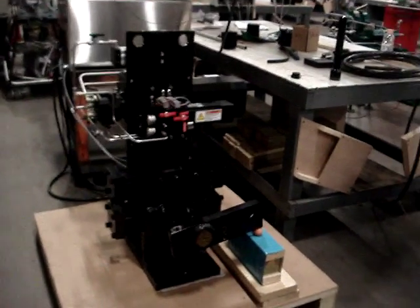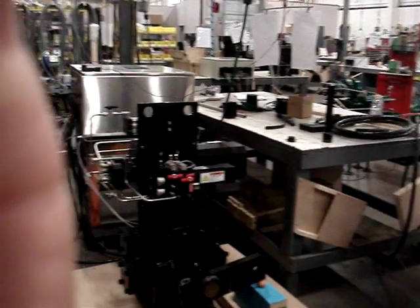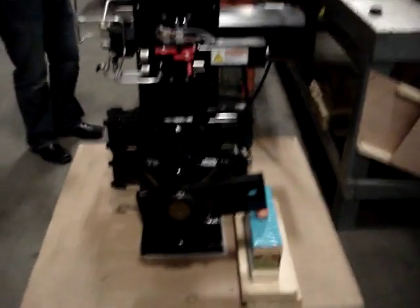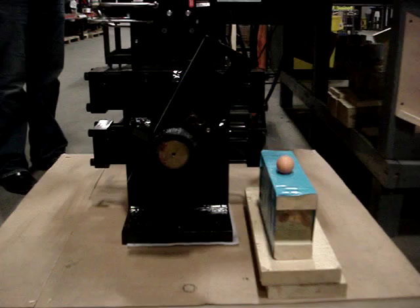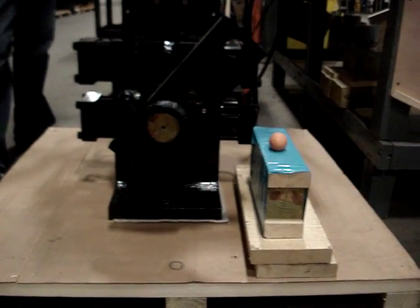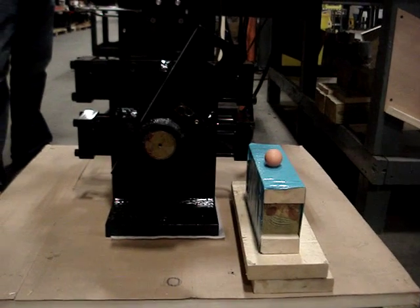So it's very stable hydraulic control. I'll just show you how it modulates. Right now we're running the drive from 0 to 90% and we'll modulate it, then we'll run it to 100%. You see that the large motor activates for large step changes, so you get very high speed and very accurate control.